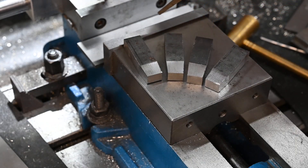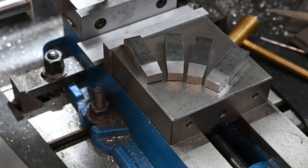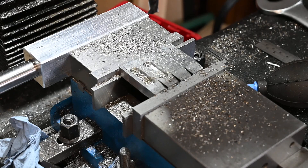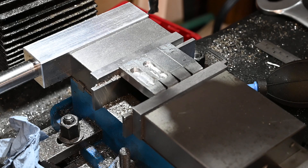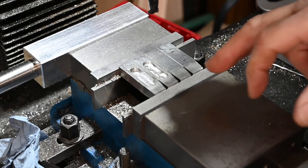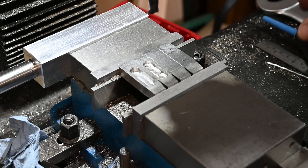I'm going to cut the slots now and drill the holes for the bolts that are going to come up from underneath to aid the clamping process. It was at this point that the cheap Chinese cutter failed - I'm guessing it didn't like plunging, but they don't really like anything. I've had to change up to a 10mm 2-flute because they'll accept the plunging a little bit more.